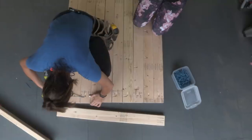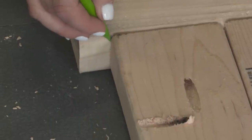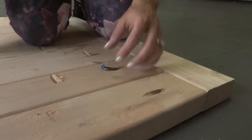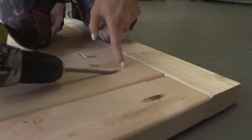Once you've got the planks attached together, you're going to get a perfect fit for the breadboard. Just do that by holding the breadboard up to the tabletop planks and mark where you need to make that cut. Then we're going back with the two-and-a-half-inch pocket hole screws through those pocket holes, and it's going to attach that breadboard to the tabletop. And then we've got a tabletop done!